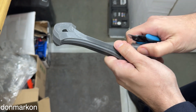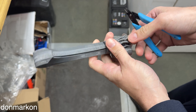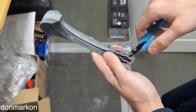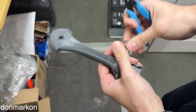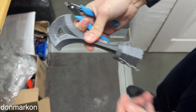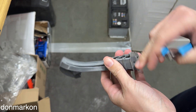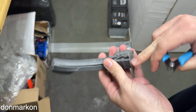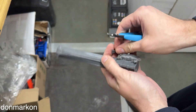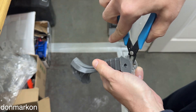This bottom part is causing some problems, but nothing major. This is a user error — I really needed to think about this because it is welded with the brim, causing the problems. Supports remove really easily; the brim is the main problem here, because the bottom part of the support is welded with the brim and the handle. I need to snap it from the bottom — you can see how easily it removes. The same problem is with this big one.